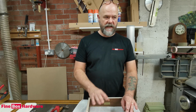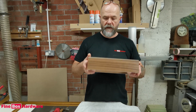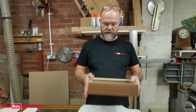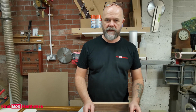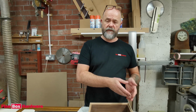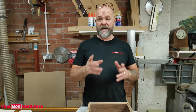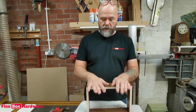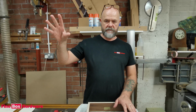What we're actually going to come out with, I want to bring people away from the router table when they're fitting hinges and locks, especially locks. When you go to fit a lock on a router table, you're upside down like that. The same with the hinge too, but the bit's enclosed in there. You're working extremely blind, and you're sliding it between stops. If you haven't set up the stops very accurately, and measured the size of your box and so forth, you can result in too snug a fit of the lock or too loose a fit. If it's a loose fit, it's not great, to be quite honest. Also, we bring out these wee shims, so with a loose fit, you can pop them in and that'll at least tidy that up. What we're going to bring out is a lock jig, so that, believe it or not, we actually have a new lock in development.